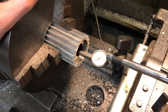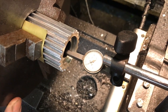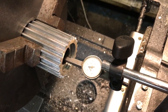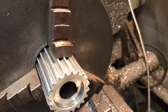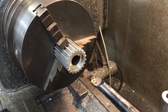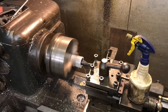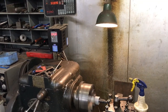As you might remember, the needle roller one-way bearings need a precision fit. My first job is to get the pulley in the lathe and bore it to size. Holding this pulley in the lathe I needed a very thin shim because the jaws aren't holding the same number of teeth on each jaw, which is throwing the bore off slightly despite boring the jaws. I spent a good hour mounting the pulley in the chuck and getting it as true as possible — that's the trouble making helicopter parts; you want everything as accurate as you can, and that takes time. I'm going to bore this pulley rather than drill and ream, because I don't trust reamers enough to get it to the right size — they can sometimes be 0.05mm oversize, and that won't be any good.